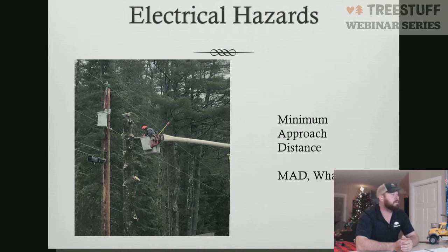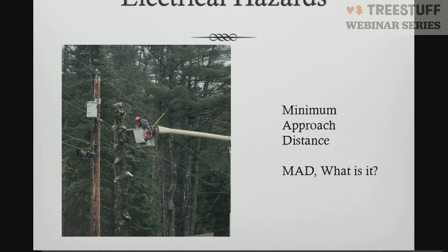The guy on the right side made indirect contact with the primaries through the piece he was rigging. Piece came down, connected with the primaries. He grabbed the piece, and thus you can see the result. So electrical hazards are something that are always present in almost every job we deal with and become a big issue with cranes. Cranes, in their own essence, are giant lightning rods. They're not grounded. They're not insulated. They're big pieces of metal that go directly to the ground.